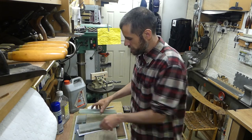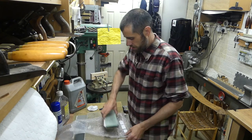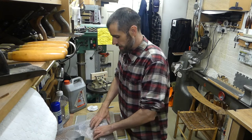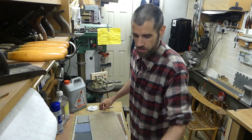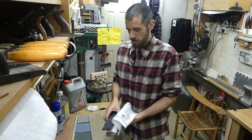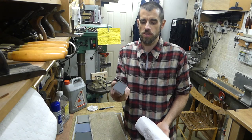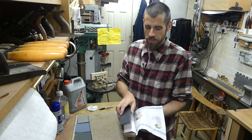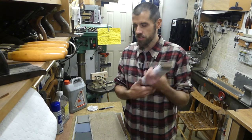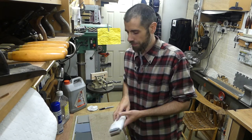These will still be useful for sharpening other tools, but for this particular purpose I've found it quite inconvenient. So I'm going to move away from this idea and go back to an old favourite of mine — wet and dry paper — which I normally use for sharpening my knives. My usual sharpening paddles are made from HDF — laminate flooring smooth on both sides — with 240 on one side, 500 on the other, then 1000, 2500, 5000, and leather on the back for stropping. That's great for knives but not wide enough for plane blades.